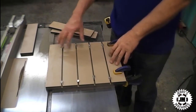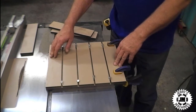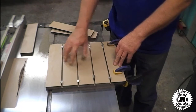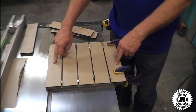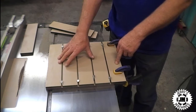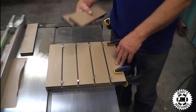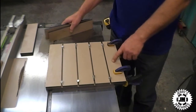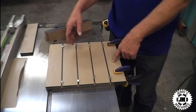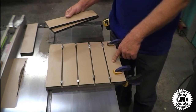Quick test fit to make sure I got everything right and square. Remember, if you're doing this yourself, these three middle pieces are going to be an eighth of an inch shorter than your two outside pieces. This one I'm doing for the giveaway — I'm going to incorporate some changes. I'm also going to include two extra center pieces and one extra end piece, so if you drill one or screw one up, you'll have one to replace it.